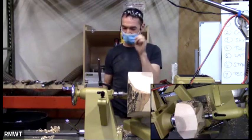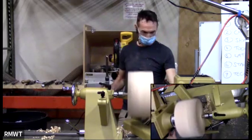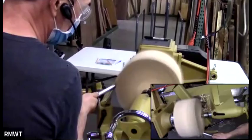So I'm going to do the perfect cut with no energy going into my body, no vibration, none of that garbage. You're going to watch. You're going to start a little slower. This lathe is moving. Okay, I'm going to go slower than I like. I'm going to go left-handed. So all I'm going to do is just glide the bevel. All I'm doing here, this is really slow, as you can see. That's me gliding the bevel. No vibration back to me. I can take a big bite.